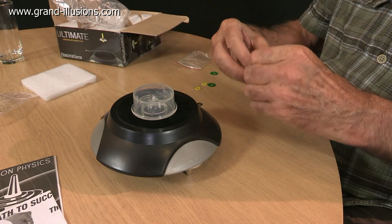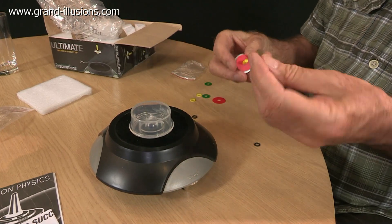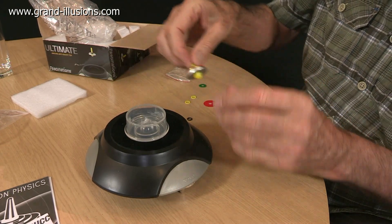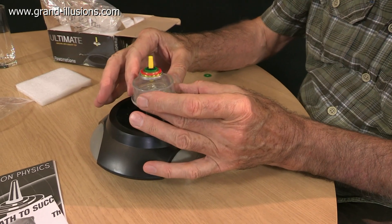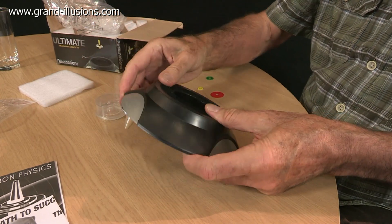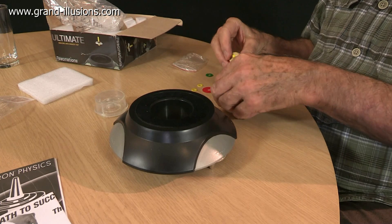That's nearly there actually, so now what I want to do is take off the next heaviest weight, which is this one here — these are a lot lighter than the brass ones. Take off that one, and I think I might put back on one of these just to get a slight reduction, because I think we're getting close to the optimum weight. I don't think it's quite levelled yet — it's starting to come towards me, suggesting I've got to make a few adjustments. That means I've overdone this leg here. I'm going to wind it in a bit — by winding it in, it's going to go a little more level — and I'm also going to take off another of the weights, because I noticed it still wasn't rising up into the sweet spot.